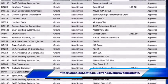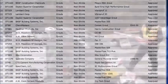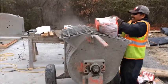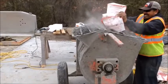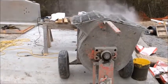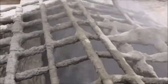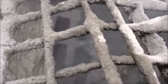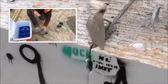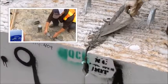After receiving the grout on site, check to make sure that it is on the M&T list as an approved grout for structures. In most applications, prepackaged grout will be used. It's important to follow the manufacturer's recommendation for mixing. Instructions should be printed on the grout bag packaging. Only when allowed by the manufacturer and the engineer, aggregate may be added to the mix. Check your special provisions and talk to your local concrete testing lab to determine if grout cubes or cylinder samples should be gathered.